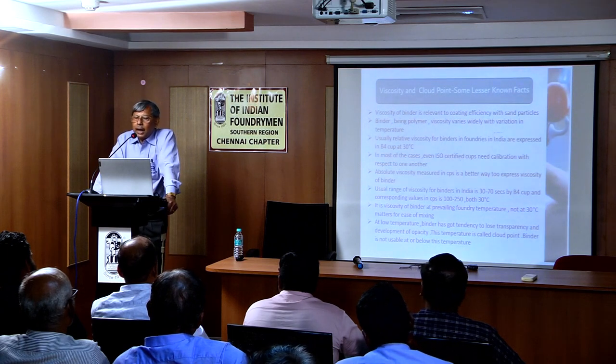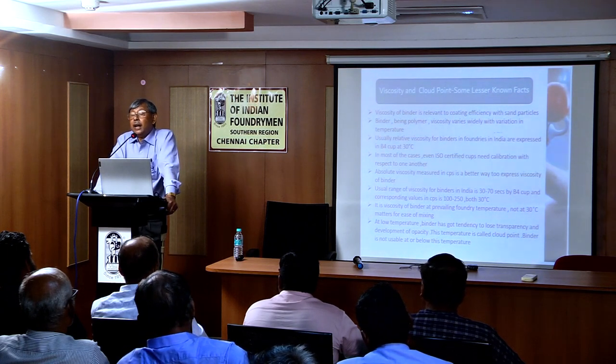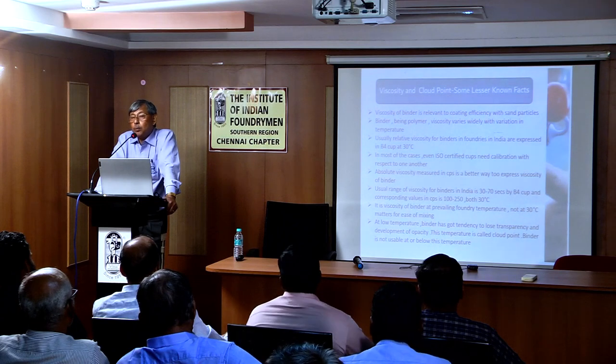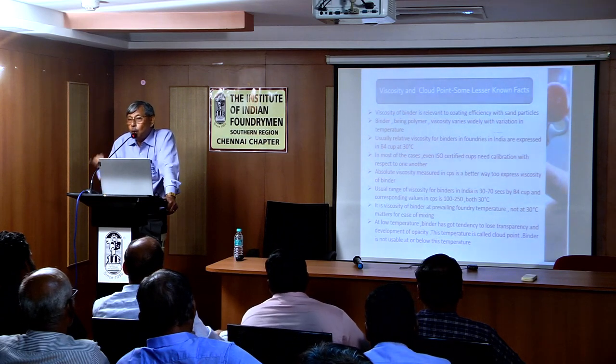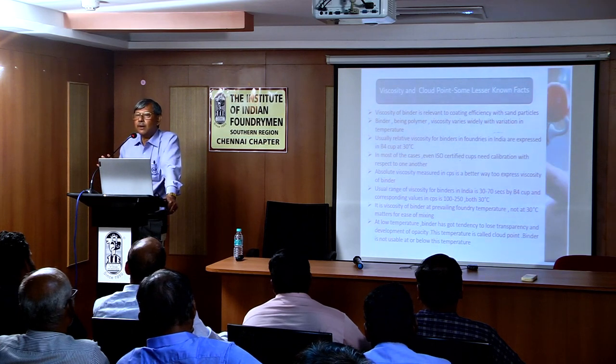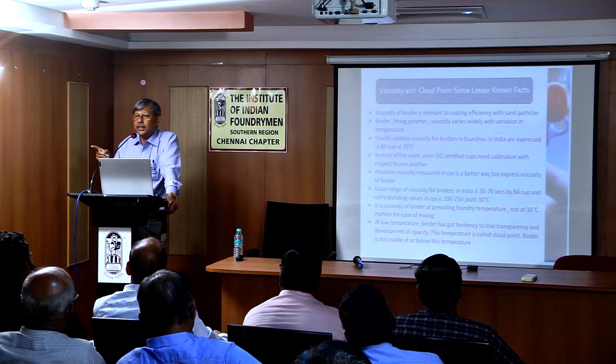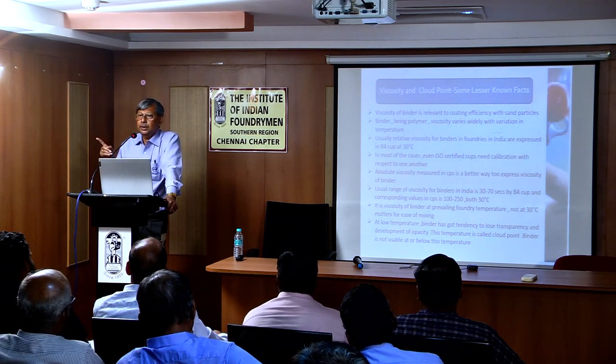So this is again a relative viscosity. We check it by Ford cup, and take it from me, even Ford cups, ISO marked Ford cups, no two cups are identical. We have got five Ford cups with us. Every cup needs to be calibrated against another, and you have to pay some money for calibration. And this is relative viscosity.